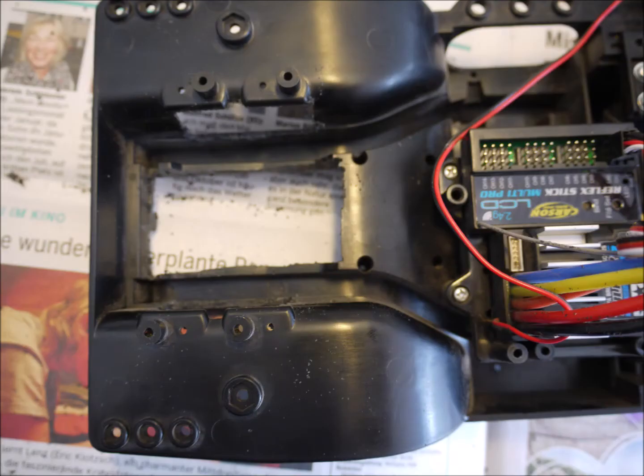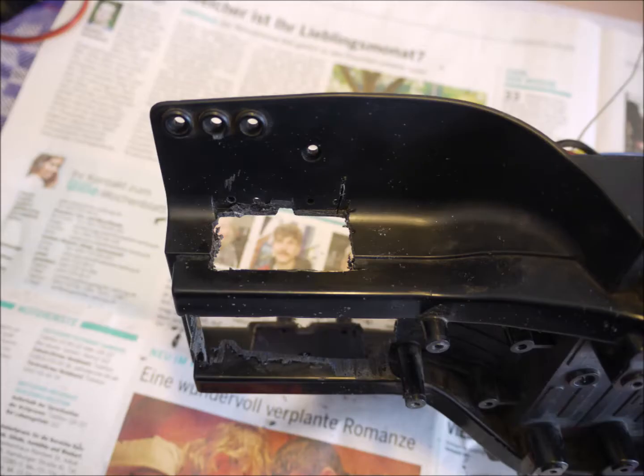In the back I cut out the bottom of the chassis, but later found out I might not have had to do that — I figured I'd be able to fit the servos easier if I did. I used standard sized servos, measured the base of the servo, and marked a rectangular marking on the inside of the wheel box. The rear edge of the servo was placed exactly under the middle hole of the three holes in the wheel box.